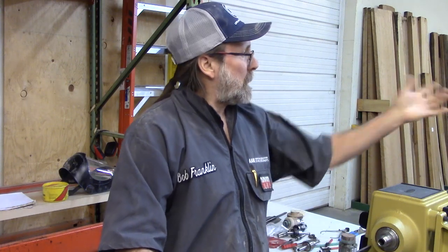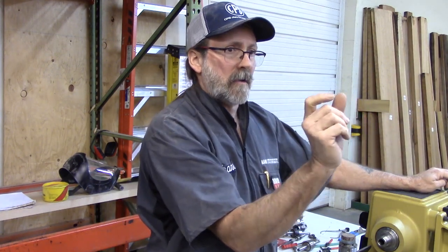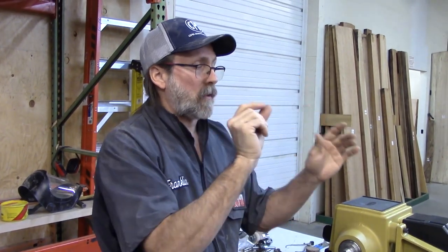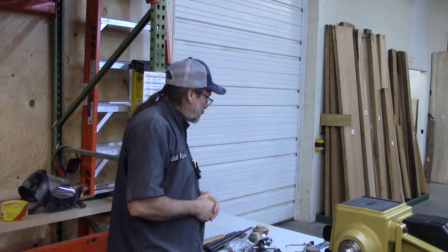Some guys do that. Ed and these guys do quite a few rings too, and one of our good friends out of the Denver Club is doing a lot of opal. So he'll take the two-piece cores like this. They make some that are similar to the two-piece. They'll have the rib on each side, but it's a single piece, and they use them just for inlay or veneers. So that core is a single with sides, and you can do opal or crushed turquoise or whatever, and you just glue it in place and then you turn it. So those are kind of neat too. There's lots of options with it.